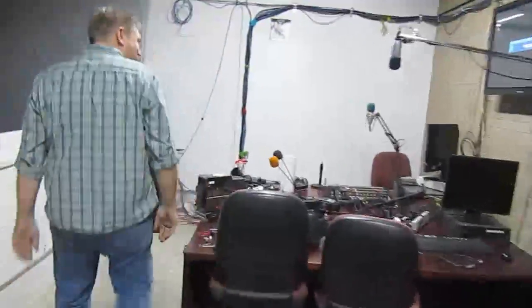22:42 hours, and now we're fighting ground loop issues. Hi, Ted. So we pulled up the other switcher unit, and replaced it with just a simple button switcher. And whenever we hook it up to master control, we get interference, kind of like vertical bands of interference. We're not really certain what's going on.